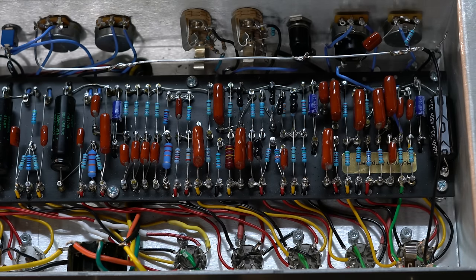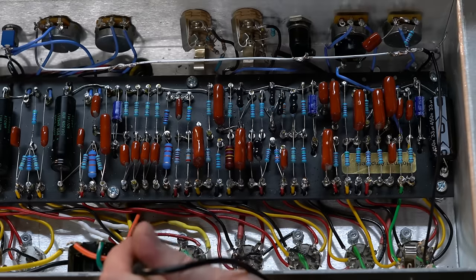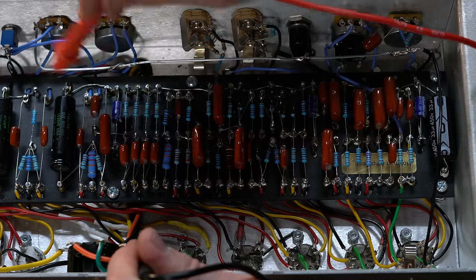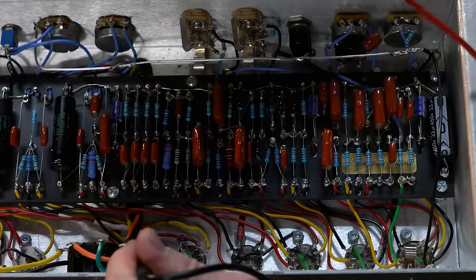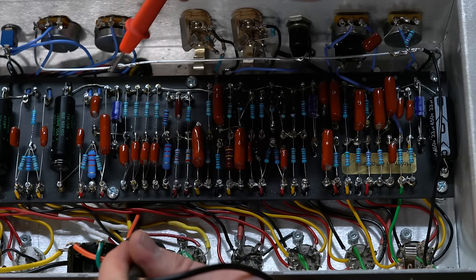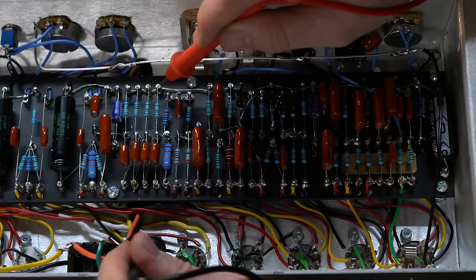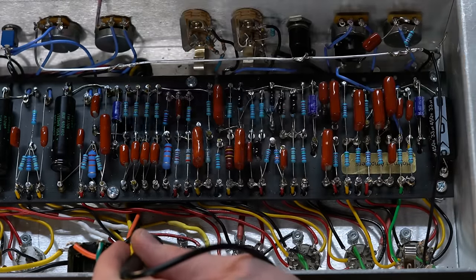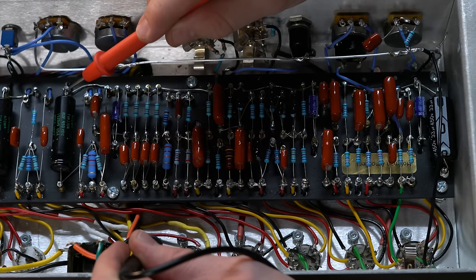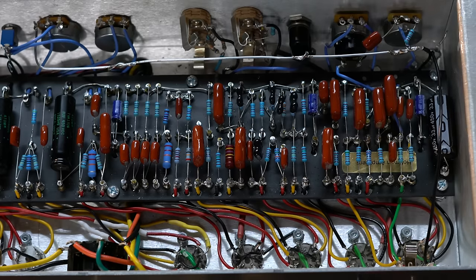I'm going to tip it upside down and shake out all the little bits and pieces. Then I'll take time to double check all of these connections and make sure they look right. I like to do a little sanity check where I touch a ground into the chassis somewhere — doesn't matter where — and try some of these points on the bus that are supposed to be grounded. I'm not touching the wire that's supposed to be grounded only; I'm touching on the leg away from it. That guarantees continuity through the leg, into the turret, through the solder connection, and then to the ground — so you get multiple checks. The bottom of this cap is grounded, so that is looking good.